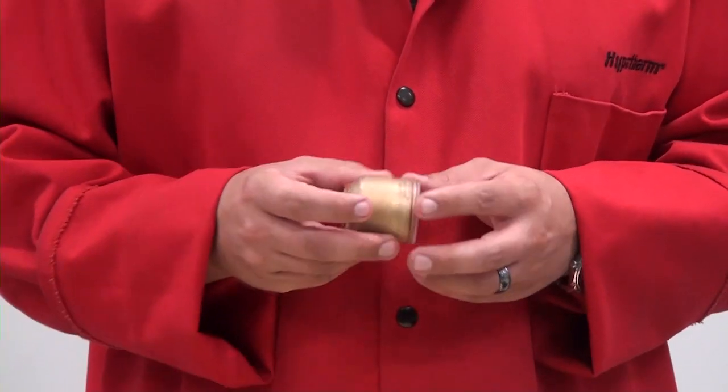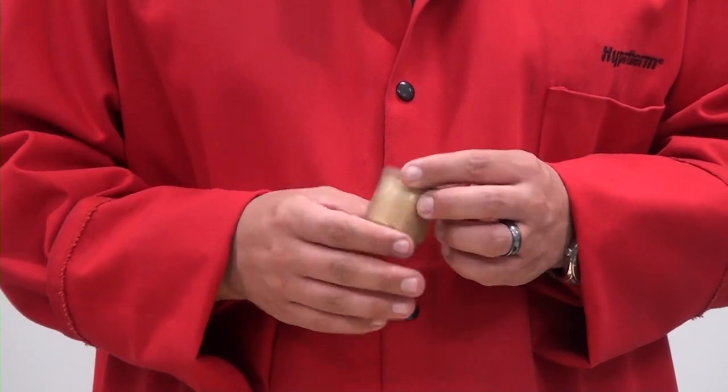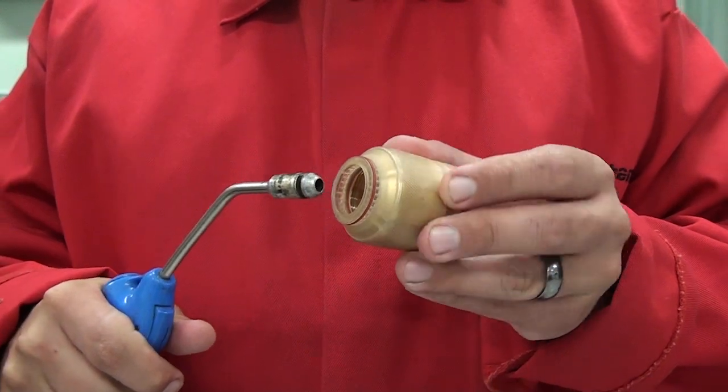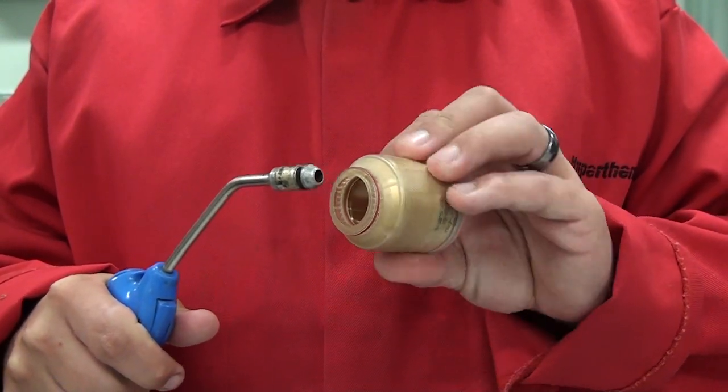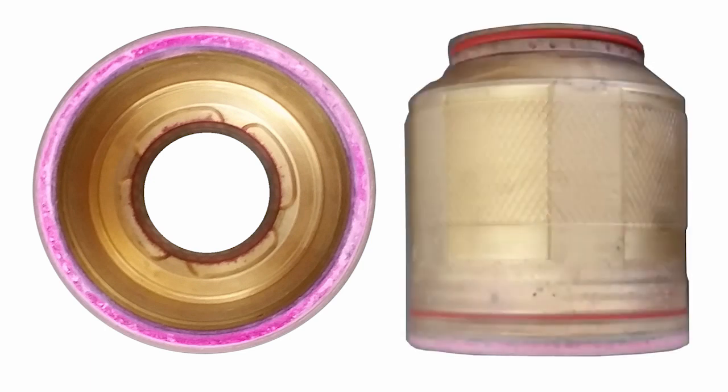Next, the nozzle retaining cap is responsible for directing coolant and gas flow. Cut quality can be compromised due to a damaged nozzle retaining cap. When inspecting the nozzle retaining cap, look for damage, cracks, or deformity to the body or top ring — replace the nozzle retaining cap if either are found. Debris may be found clogging gas ports and can be cleaned with compressed air. The nozzle retaining cap may also show signs of discoloration due to coolant flow; darkening or pink colorization can occur on the upper inside area, and pink coloring may also be found underneath the plastic. If water is used for cooling, no pink coloring will occur. Darkening and pink colorization are normal and do not degrade consumable performance.